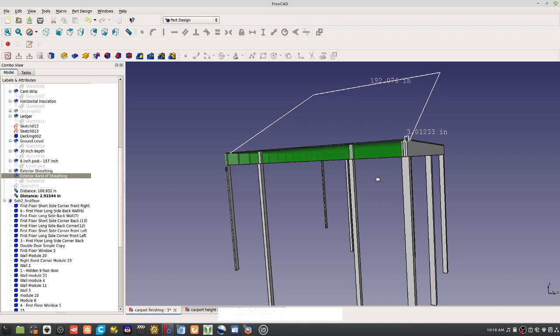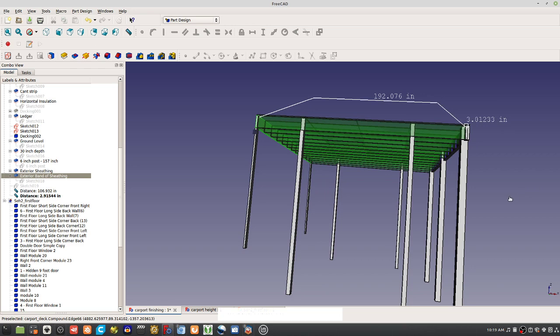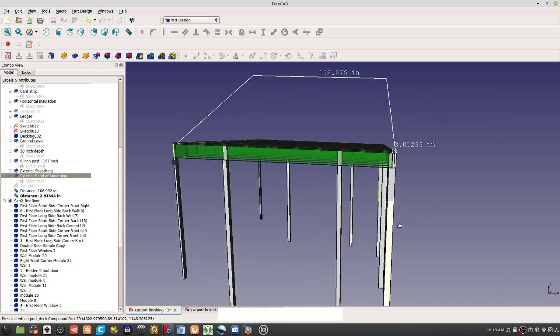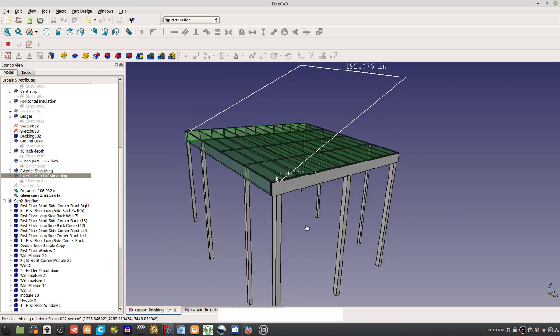We don't have to be super, super precise, but with a bubble level, we can get that plumbed relatively easily. Yeah. Wow. So that's a carport. And the challenging thing about it is, unlike the house where we had a foundation to know exactly where we put things, here you've got to measure them and figure them out. So that's the harder part.